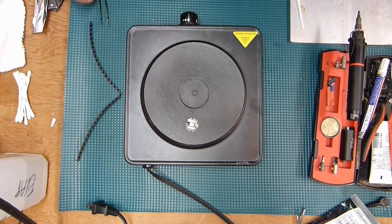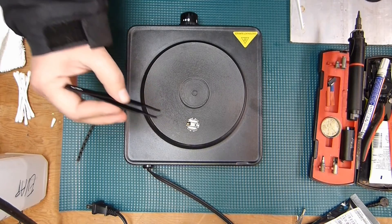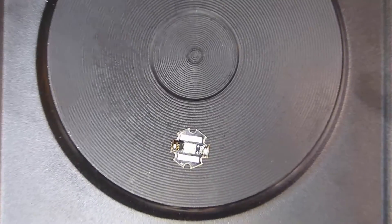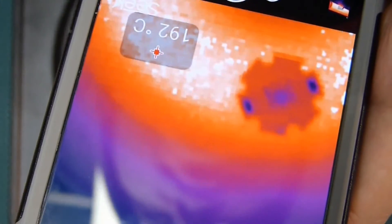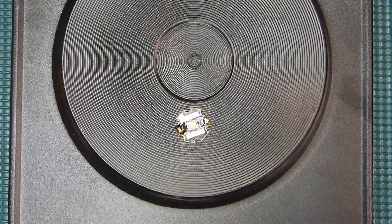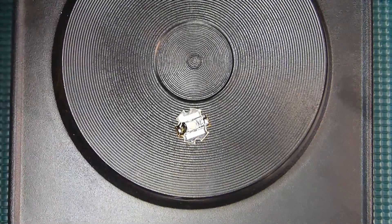Now let's look at removing the LED chip from an aluminum star PCB board. It's starting at room temperature, so I place it down and plug in the hot plate. Skipping ahead, we're getting close to the rework temperature — the correct transition temperature needed to pull the LED off safely. You can see the flux on the power input pads and those big blobs of solder starting to move — we're pretty much ready to remove the LED chip.